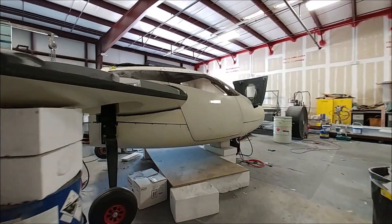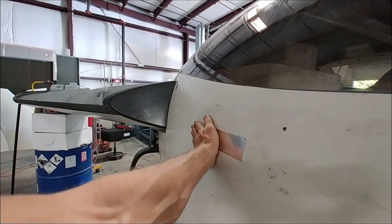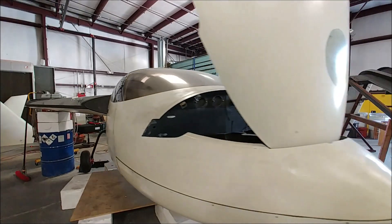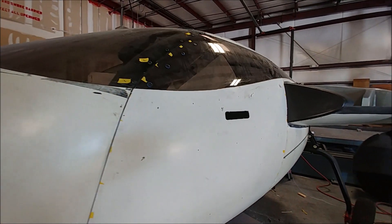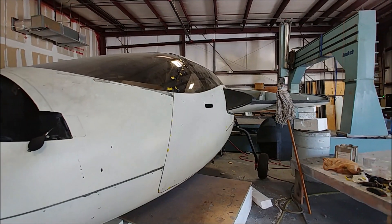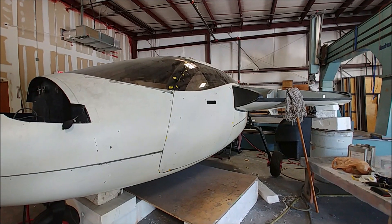I put some metal tape over that door handle because those bits of green tacky tape had pulled through when we got to about 2.2. In the next iteration we took that off, fixed those bits of tacky tape, put a little strip of carbon fiber in there. That one had gone out and was leaking through there as well. We got to a point where we said, let's stop, fix that, and then have another run to make sure we're not losing too much pressure out through these larger holes. But overall everything was going pretty well.